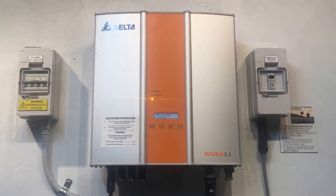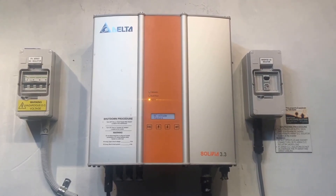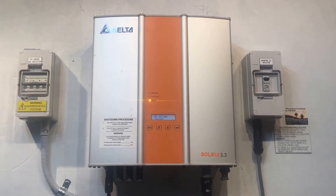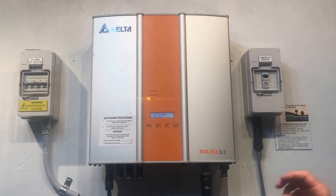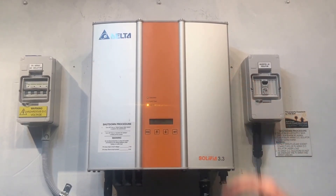You are going to need to get in contact with a solar accredited electrician to check your system out. What they're going to want to check first is to pull this plug out and put a multimeter inside the plug and just check that it is actually getting 240 volts from the electricity grid. If it is, well we know that it's a problem inside the inverter, because the inverter is actually getting AC voltage.